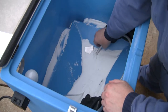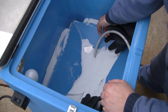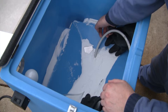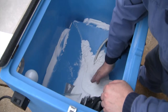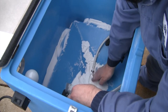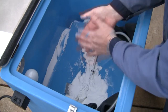If that test works, we're going to go about an inch to inch-and-a-half above the media level and put a small hole in just the outer line — making sure we don't punch through to the inner air hose — about a three-sixteenths or quarter-inch hole, so it can draw enough air in and mix it with the media. First I need to clean media out enough to get a screwdriver on the fitting and disconnect the hose from the bottom.